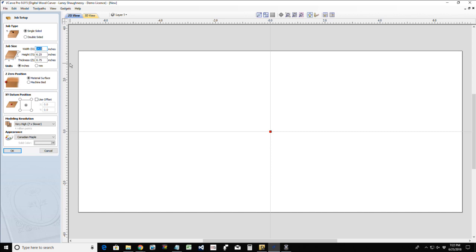And depending on how you approach actually making the cutting board, I'm going to be showing making one that is basically your panels or boards edge glued, so you're working on a face grain. But when we're talking about the inlays, a lot of times those would be done in an end grain cutting board. Now there are a lot of videos out there on YouTube about how to make a cutting board. Once you cut up all those blocks and glue them together for your end grain cutting board, you could then bring them over to your CNC and do some final touches, such as inlay work and laser work if you're going to do some custom carvings like your brand.